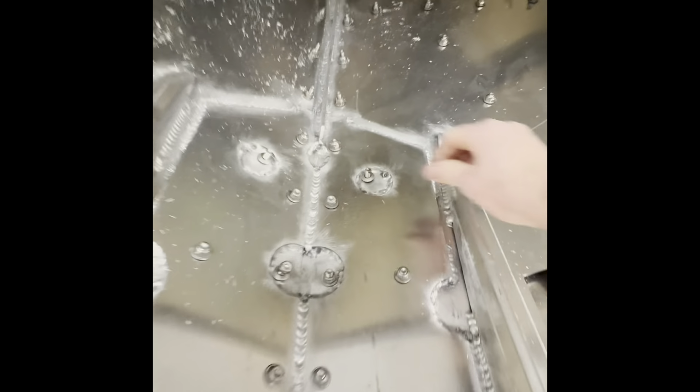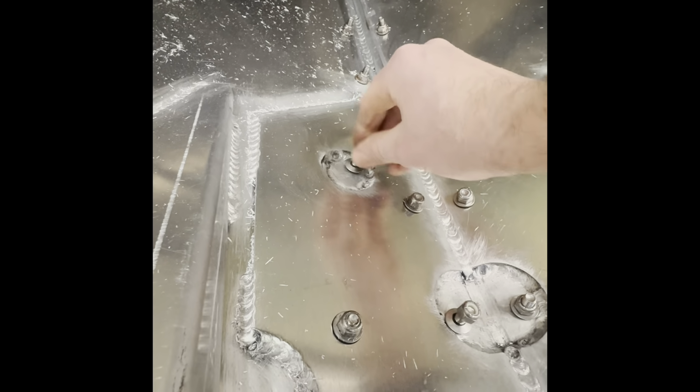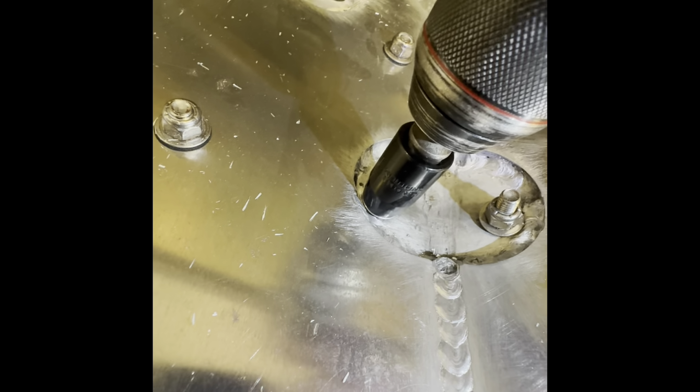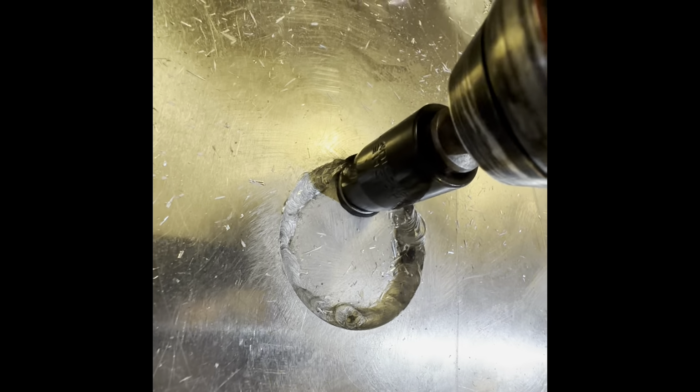Another thing, putting these down, I turn the speed down on my drill just so that I'm not going too fast once I get past the nylock, and then you're smooth sailing. That's what's gonna keep that screw staying in place. And then stop when it starts to balloon out. You don't want to split the rubber. That one ballooned out a little bit too much, but that's fine.